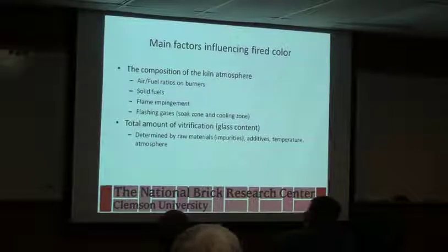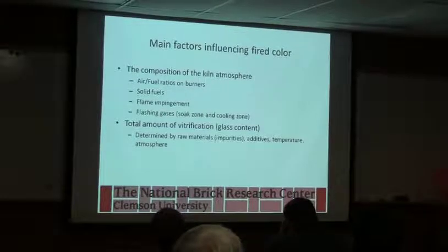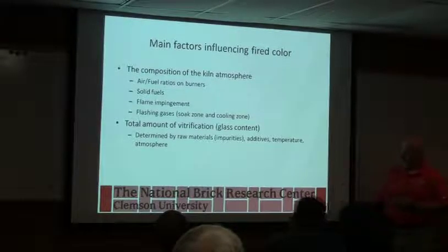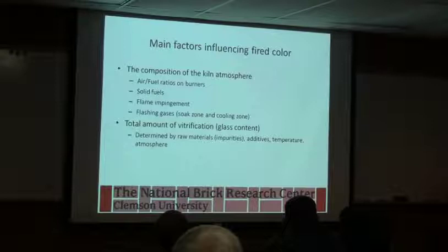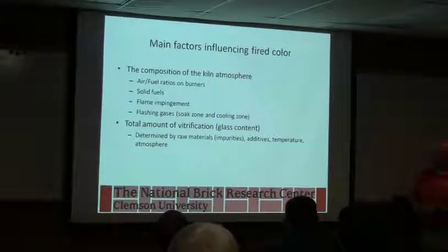It would be similar to that, but remember we talked about material having to go through endotherms in your kiln? Well, you've just taken that out. Any of those reactions, you've already made them go away. And glass, for example, has been fired to a hot enough temperature. We'll talk about emissions later, but they've fired it hot enough. They've driven off the fluorine, the chlorine, the sulfur. So it's a clean additive.